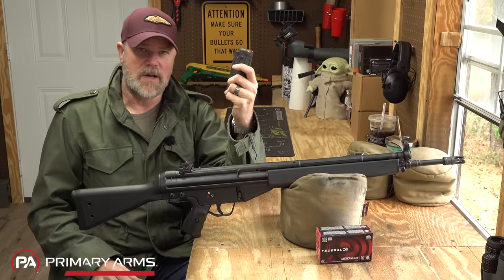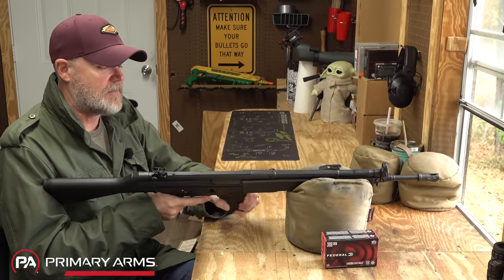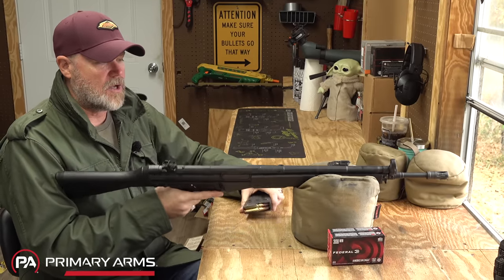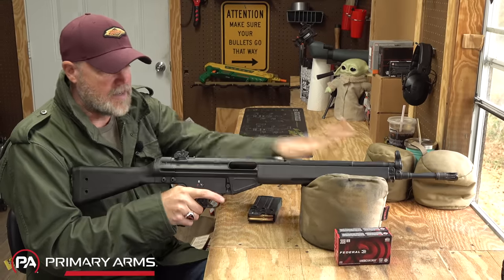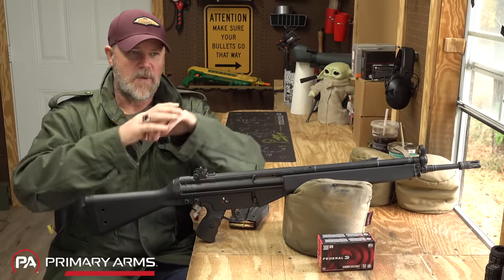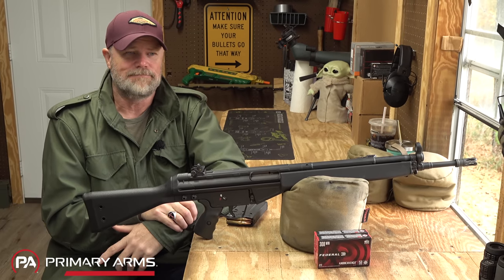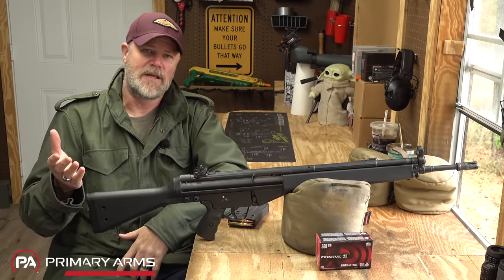But in the grand scheme of things, the gun lacks a last-round bolt hold open. Every time you go to reload with a full magazine and the bolt home, it can be very difficult to get the mag to properly seat — you think you got it in there, you don't, then you go to cycle the bolt and your magazine falls out. The best way to load a rifle like this is to first lock the bolt to the rear, take the spent magazine out, put the fresh one in, and then slap it home. That's time-consuming and draws your focus away from the fight.